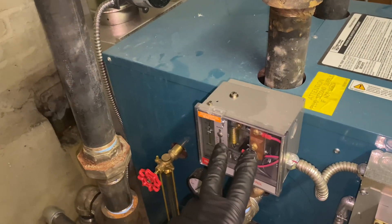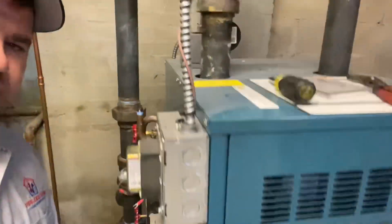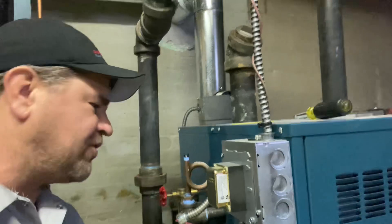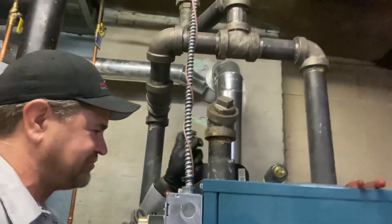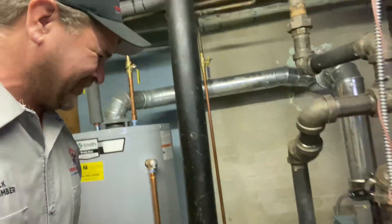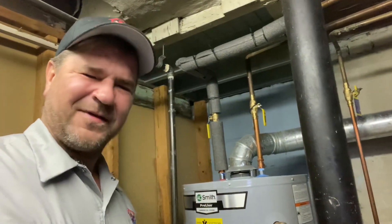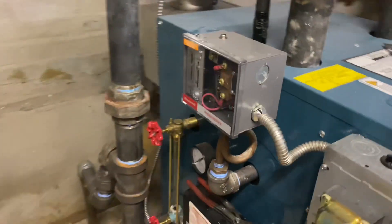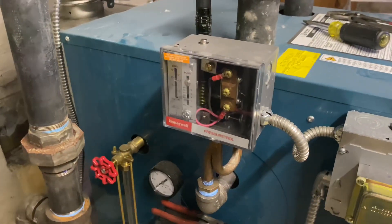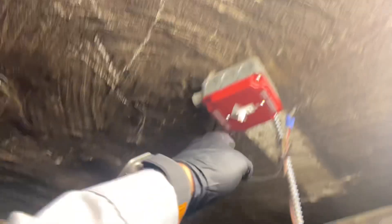While that's draining, we're going to turn the power off, take out the pressure trol, remove the two wires, and take out the pigtail. I'm going to blow on it to clear it out. It's clear. My pressure trol is back in place and wired.